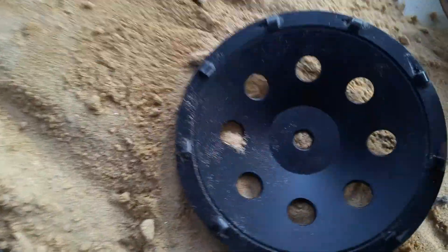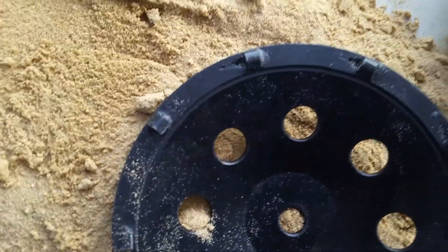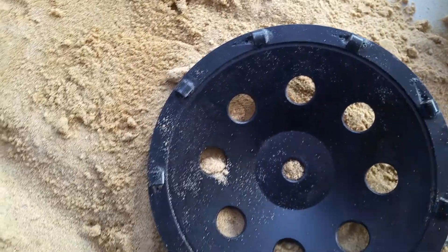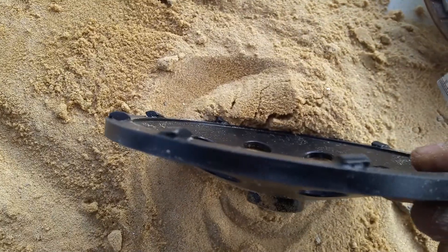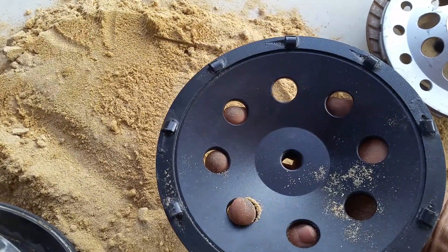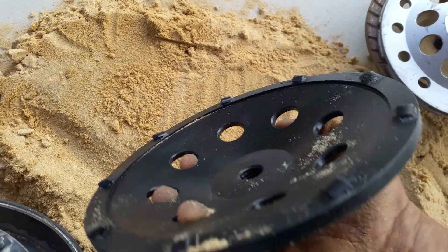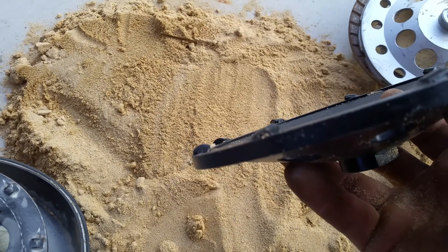This last aggressive one is just going to take it all off - it's going to be an aggressive grind. You're going to get down to the concrete with this, depending on the thickness. There's really nothing for it to heat up on that little surface area. Your entire working area is very limited - it's the top of these teeth. You could calculate the tips of those and at any one time you might have somewhere around one inch or less of total combined surface area.